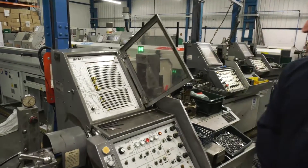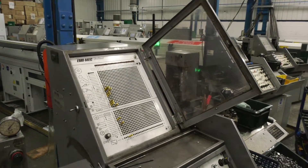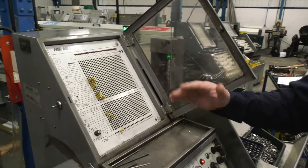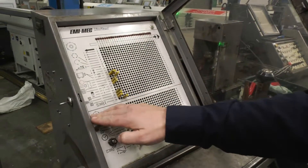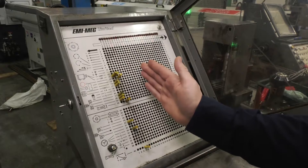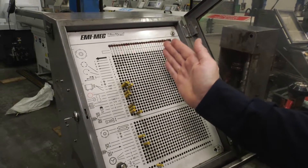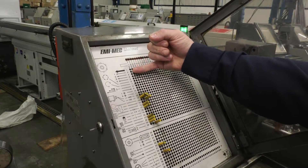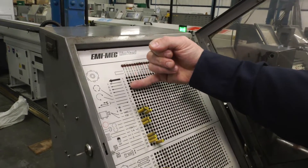I tried to learn a bit about it, but it's all too confusing. James, talk me through this plug board. So this machine's programmed using a plug board, essentially. All the operations are controlled by everything above the black line, and it follows sequentially step-by-step from left to right. For example, here you can ask the turret to come forward at a number of different speeds, one to four.